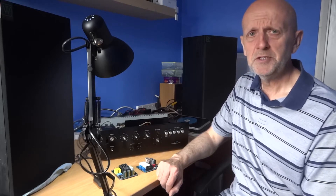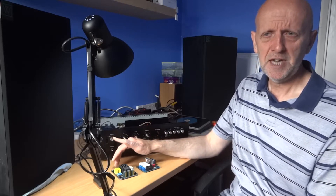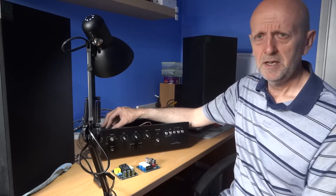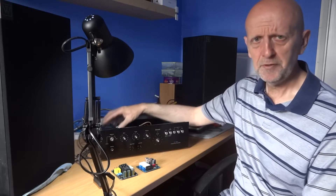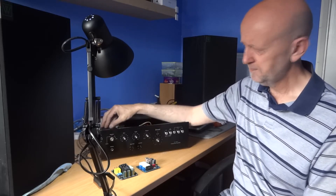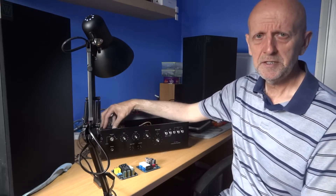You may notice when turning on your amplifier or receiver that you get a sudden thud going through the speakers, depending on how your on/off switch is set up. What typically happens is when you first turn on your amplifier or receiver, the transformer draws a lot of current until the electric field builds up inside the core of the transformer — then the resistance goes up and the current goes down. This puts a great strain on the transformer itself, and also the diodes and capacitors early on in the circuit.